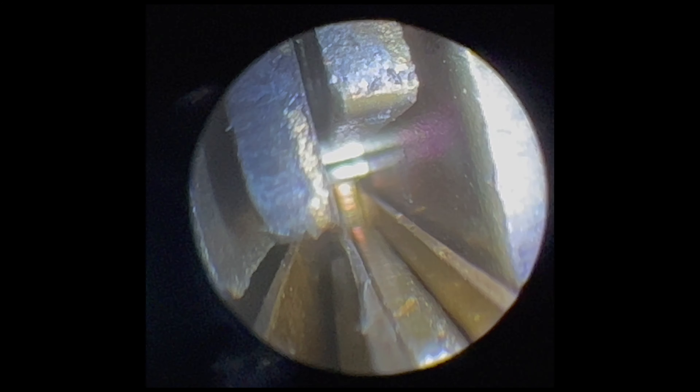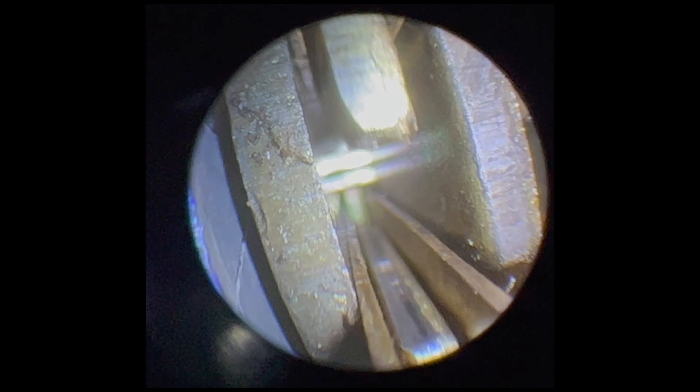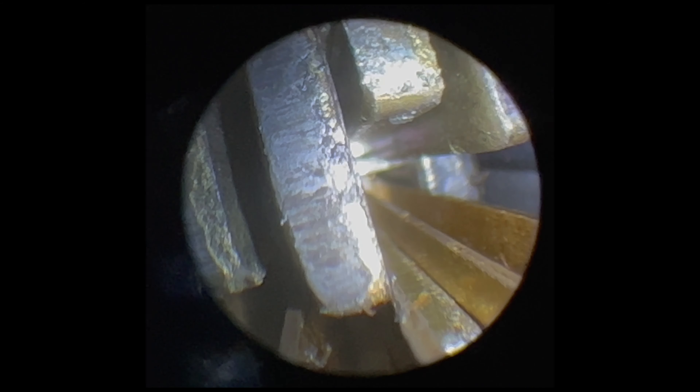Three is up but it's not going to stay there. Moving back to two and one - lever two is a much higher lift and one is a really high lift. This is typically inside a lever lock when you first start - you just have to nudge backwards and forwards until things start to make sense. I'm just going backwards and forwards, giving them little lifts on these levers, and it feels like the back of the lock might be starting to bind.